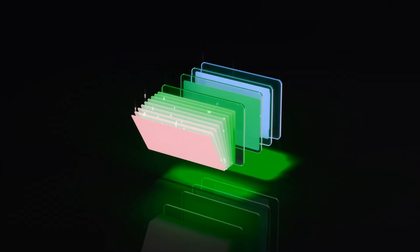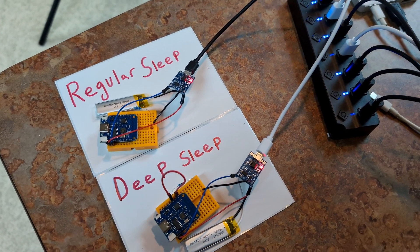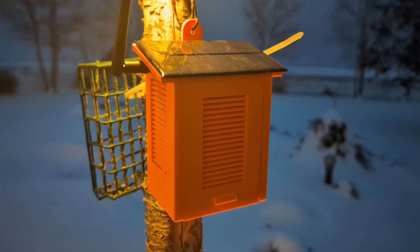The reason these died so quickly was, for one, the small size of the battery, and for two, the fact that it was doing something pretty energy-intensive — connecting to Wi-Fi and transmitting data. So if we were to space this out, I would expect to see substantially longer battery life and maybe even better gains from our deep sleep program. If you want to try out this deep sleep experiment for yourself, my code is available in the GitHub repository in the description, and the parts only cost a couple of dollars. You can just download the code, replace your Wi-Fi credentials and Adafruit IO credentials, and get started logging battery life, temperature data, or the result of Wi-Fi scans.